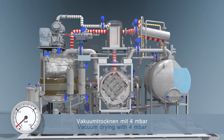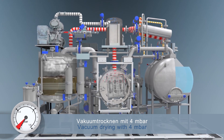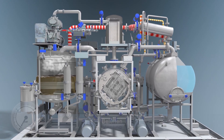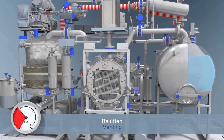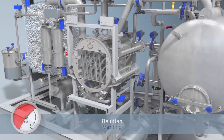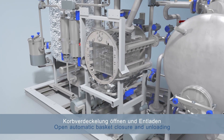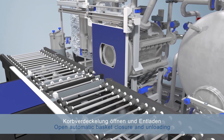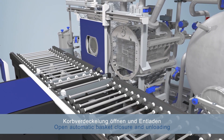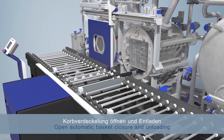So why do you need all these different options — the immersion, injection, vapour? To clean parts needs multiple processes. A bit like washing a breakfast plate at home: you rinse the particles off, you use soap and water to degrease it, you rinse again and dry with a cloth. Now depending on the material, the product, the shape, whether it's a bulk fill or individual parts, to get to the contamination you may need different processes.